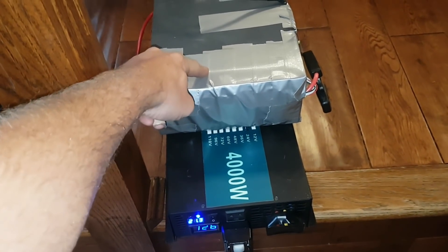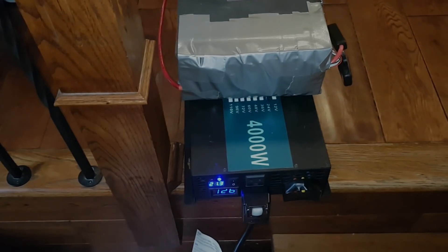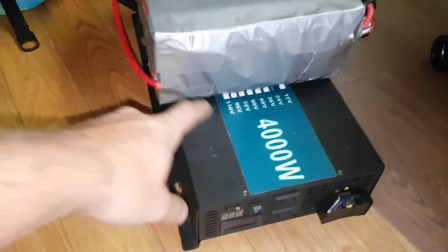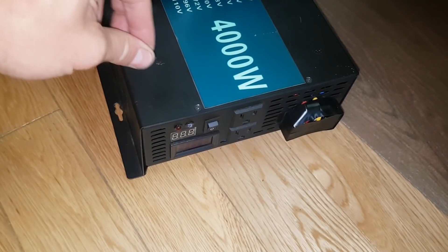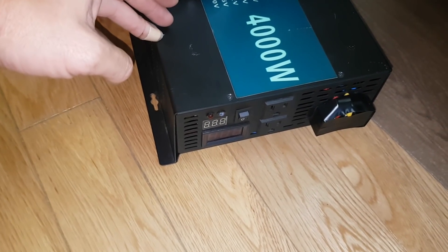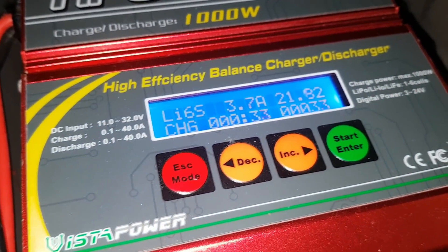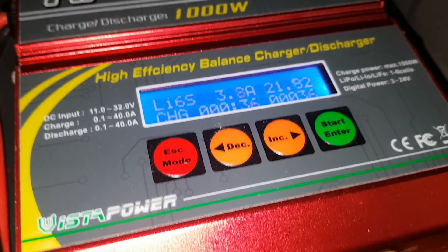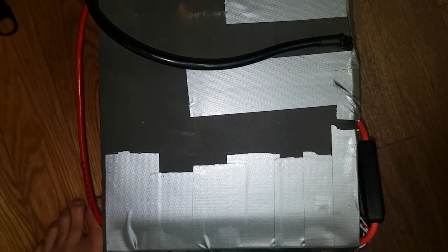Jeff is actually starting a lithium solar system as well — he's just switching over from lead acid to lithium, you guys should definitely go check him out. I just ran down to 20.5 volts and then the beeper turned on. I forgot that these things have those beepers — I'm going to take this apart and rip it out, I just don't like beepers. I like to let them just die in the middle of the night while I'm sleeping. Everything worked really good. We're charging it back up at 3.8 amps — the voltage was actually sagging through the wires so it was probably closer to 21.5 volts, so there's still quite a bit of usable power left. Thanks for watching.